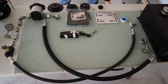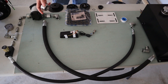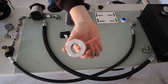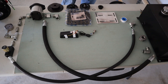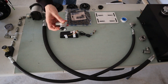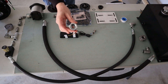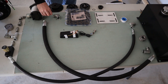You have to be really careful so you don't blow yourself up in the process, but hopefully at that point you know what you're doing with welding. Coming out of the tank, I have a 1/2-inch by 3/4-inch adapter. Then I have an elbow that's 3/4-inch by 3/4-inch. The second hydraulic line coming out is a 3/4-inch by 4-foot long hydraulic hose, going up to another 90-degree 3/4-by-3/4 elbow, coming into my 3/4-inch NPTF female by 3/4-inch ORB or SAE-12 male fitting with an O-ring going right into the pump.